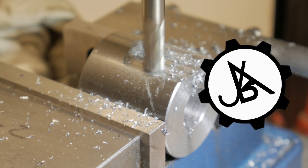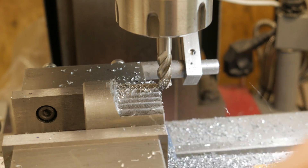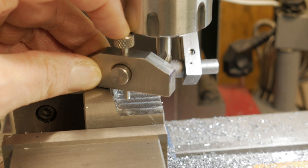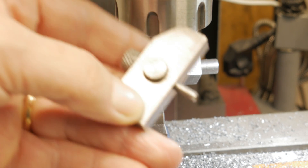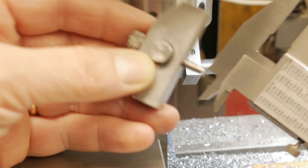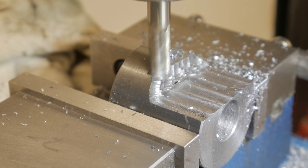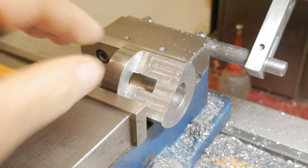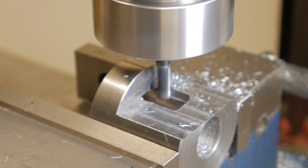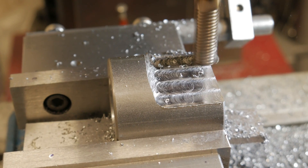The refined depth was measured with a depth gauge — a small but fantastic tool that is itself another shop-made project. It measures under the head of the milling machine where a normal gauge would not reach. I had finally arrived at the end of the first side, and the pocket appeared as per the drawing, whose function is to allow chips to be discharged during the threading phase. I then repeated the same process on the opposite side, and with my gauge I positioned the face parallel to the device. Another 30 minutes of milling machine and the second pocket was done.